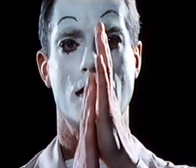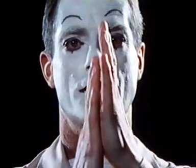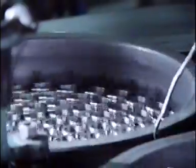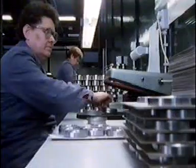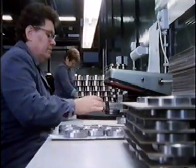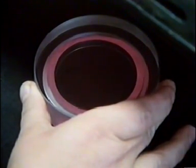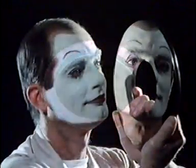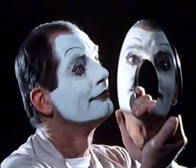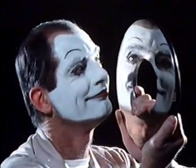Even finely ground surfaces still have a certain degree of roughness. This roughness must be particularly small on surfaces that slide against each other. Consequently, stationary and rotating seal faces are not only ground, they are also lapped. Lapping gives the seal faces a higher bearing surface, thereby increasing the load capacity of the seal. The sliding faces must be absolutely flat and smooth with a mirror finish. That is the first rule.